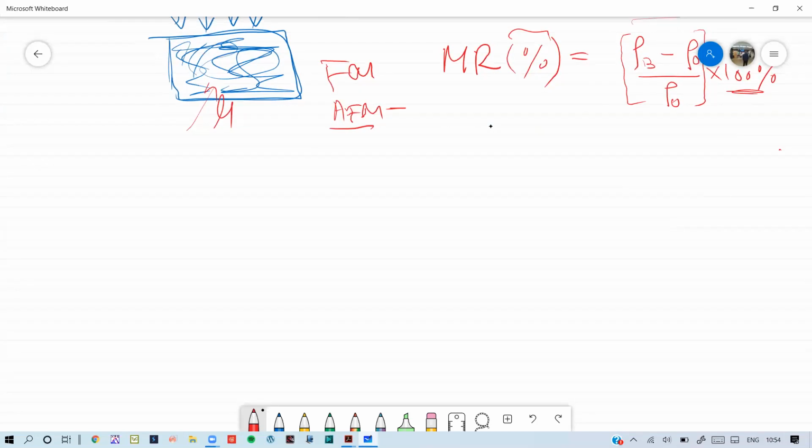What actually happens in a magnetoresistance? Before moving to that, I will tell you that there are different effects of this magnetoresistance depending upon the magnitude, how much the resistance changes. For example, its resistance can change up to a few percent. Few percent means, if it has a 5 ohm resistance and it changes by 10%, that means 10% of the 5, so it will be something like 5.5 ohms.